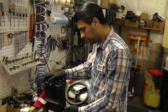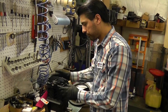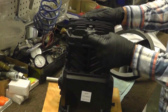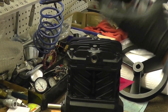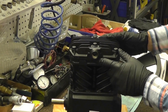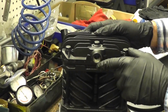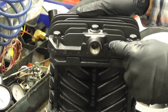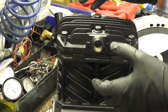This is the newer VT Victor Tango pump that has been used since the mid-late 90s. This pump has one intake and one exhaust line on the exhaust side. Your older Speed Air, Dayton, and Campbell Hausfeld compressors under those brands had two lines coming out of the head — one exhaust line for your transfer tube or supply tube, and a smaller quarter-inch connector line for your unloader line to route to your check valve so it unloads the pressure when it shuts off.